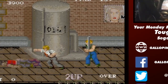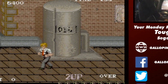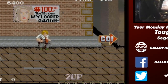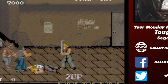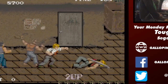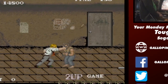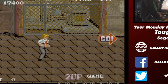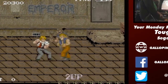So this cabinet, we picked the cabinet up from Troy Smith of Tilt Amusements, good cabinet, needed a little bit of work. It had a 19-inch monitor in there, so we upgraded that. It is supposed to usually have a 25-inch monitor in there. We didn't have a spare fully working one, so we had a tube that we just picked up from Jeremy Fox. I had an old K7000 chassis, so I rebuilt that, but while it had a new flyback, it needed a horizontal transistor because it was blowing the fuse. So I put a new transistor in, and the monitor was working.